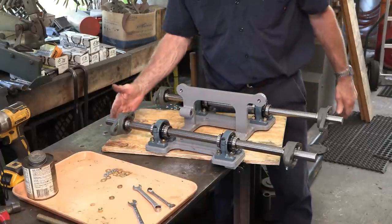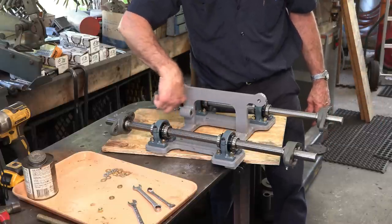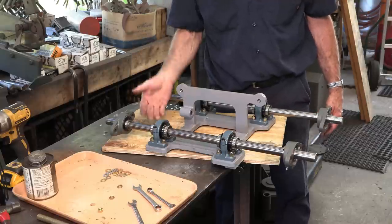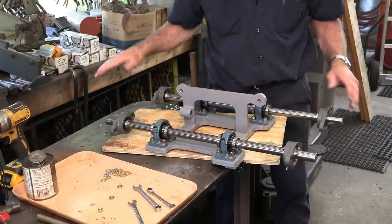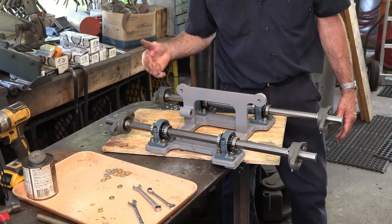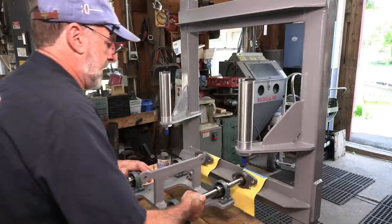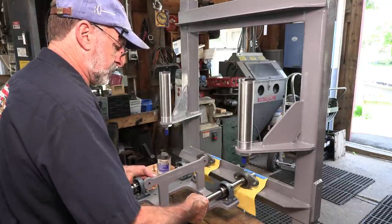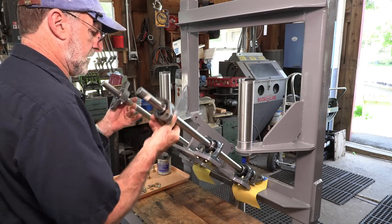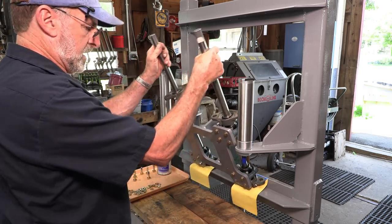All right, this is the bottom and this is the top, because this is the locator or the adjusting screw for your stop on your down travel if you wanted to set it or raise it up for doing routing and other accessory cuts that this drill press can do. Okay, I put a couple pieces of paper there because I'm just resting those right there. And then I'll slowly pivot this up in place.